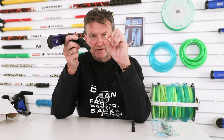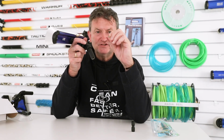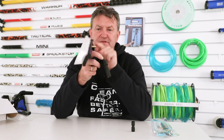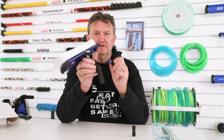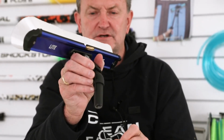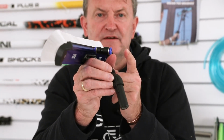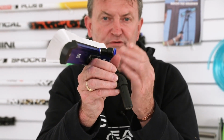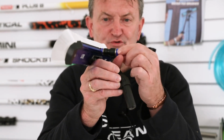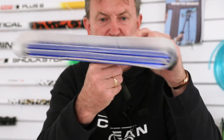So there's a little filter in every light and ultralight brush, this size, tiny, and its job is to sit in here into the brass, and then we can put the push fit over it. You got that? I got it. Then we put the push fit on, and now we have a 10 millimeter high flow 3/8 inch OD tube input into the brush.